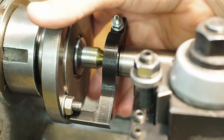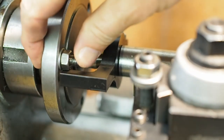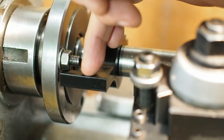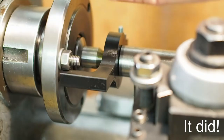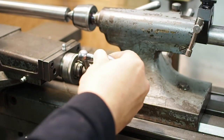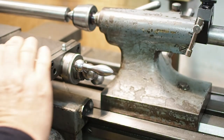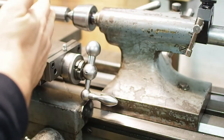This is now the second lathe dog I've made. You can see this time I've put an extra leg on it so I can use a much shorter bolt to drive it. This is obviously going to be loaded along the striations of the 3D print, so it may well be too weak, in which case this extra dog leg may break off — worst case I'll just put the longer bolt back in. After I adjusted the top slide I'm now getting contact, which is one of the issues with this lathe: because the top slide is mounted quite low with quite large ball handles, you tend to get interference when doing weird angles.